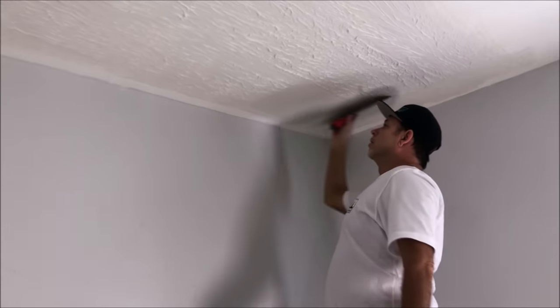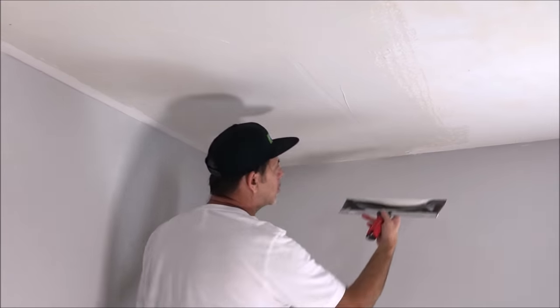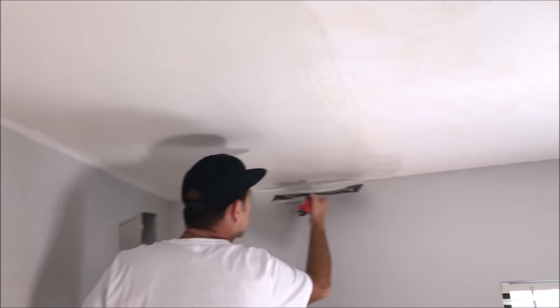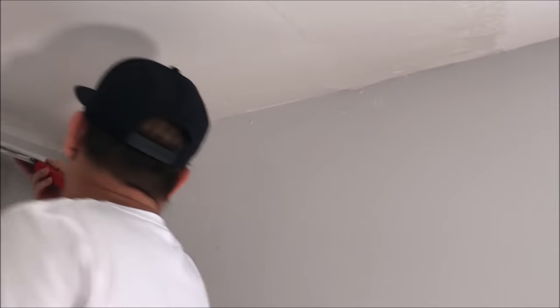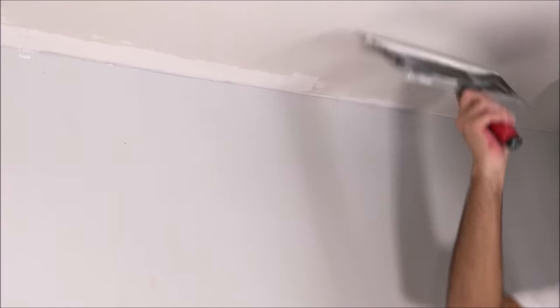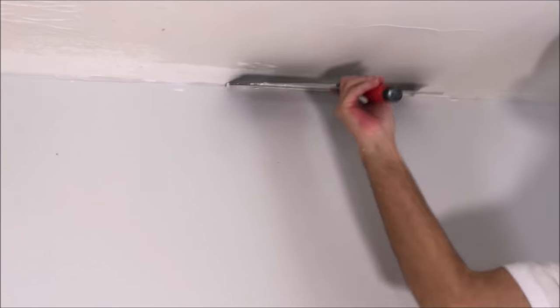All right, so let's wipe this down. I'm basically just going over it with a light touch, minimal pressure, just evening it all out, seeing if everything's covered real good. Now you're going to have to pay special attention to the corners, especially on each side of the room and at each end. Just go around with a little bit of joint compound on my knife, keeping it real thin, trying not to get it on the wall.